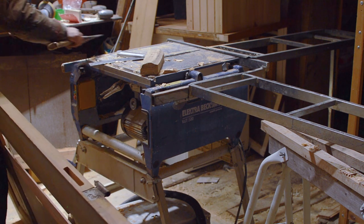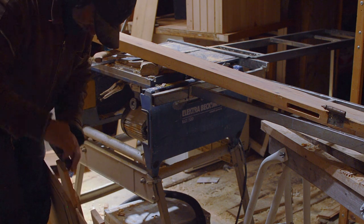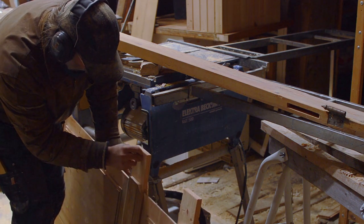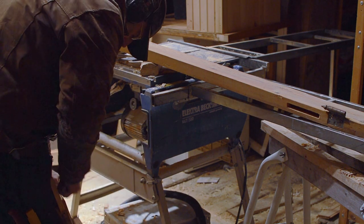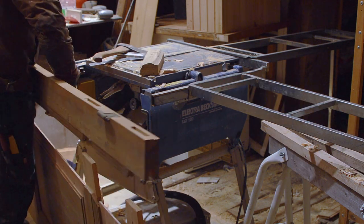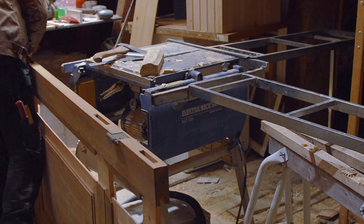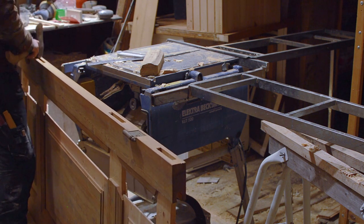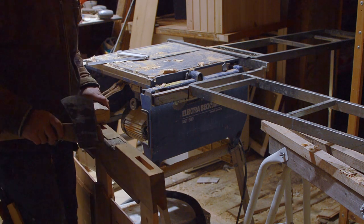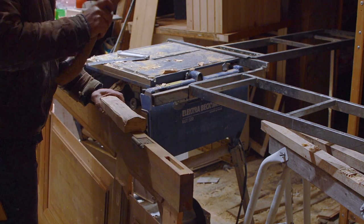Just trying to do a dry fit, but it's a little bit tight, so I'm going to take it off again here. A little bit more adjustment. And then I'm just beeswaxing the surfaces so that it'll slip on a little bit more easily. So the job's almost finished now. This has been a Strömmen Trävaru Fabrik building, built around the turn of the century, 1900, a little bit before perhaps. And it was owned by one of the owners of the factory. Once this has been knocked back together, it's ready to go really, put back in its frame, taken up and put in place in the cabin.